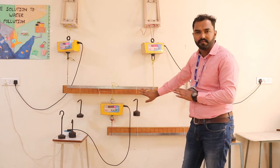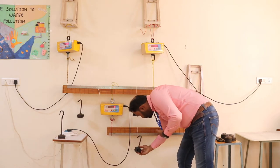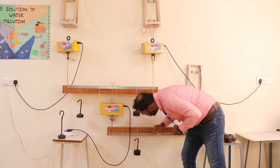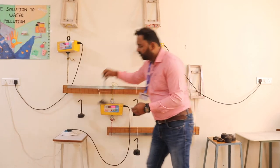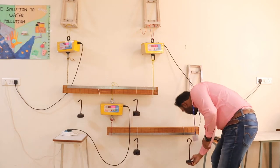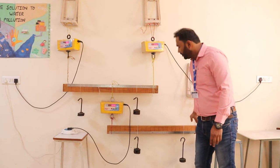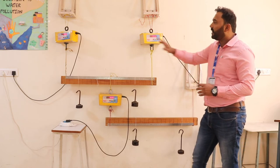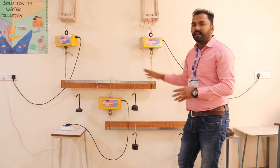After adding W1 and W2, points A and B will show different readings while C is still zero. Now add W3 — another 1.5 kg — for beam CD. Since beam CD is an inverted beam, W3 is placed at 70 centimeters from point D. The last weight, W4, is placed at 15 centimeters. You now have distances L1, L2, L3, L4 and weights W1, W2, W3, W4, along with reactions at points A, B, and C as experimental readings.